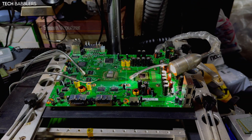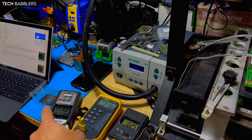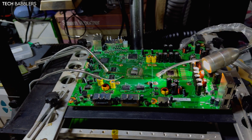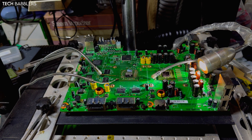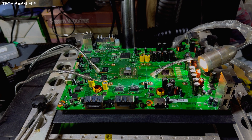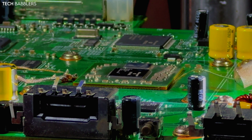I'm going to set you guys up in time-lapse mode. Lift, clean — that chip is already leaded so we don't need to worry about that. Put it back on, flow it at 185 to 190 and we'll be golden hopefully. So that's a quick rundown — let's set up and do it while the profile is running to heat the console to the required temps to remove the GPU.